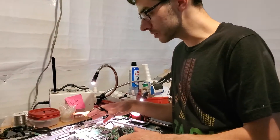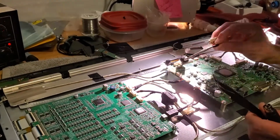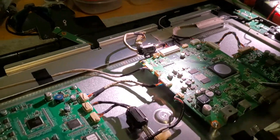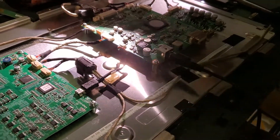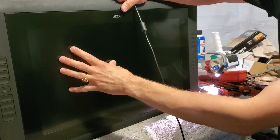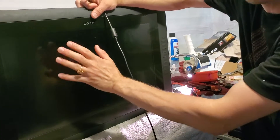You get the board down to this, and all you have to do is remove this cable which connects up top here — just simply unplug that — and then you plug the power into the main board right here. You're going to go look at the front of it, and when you plug that in, either you'll notice that this will glow a slight purple-lit color for a moment, or it won't. In this case, it's not.